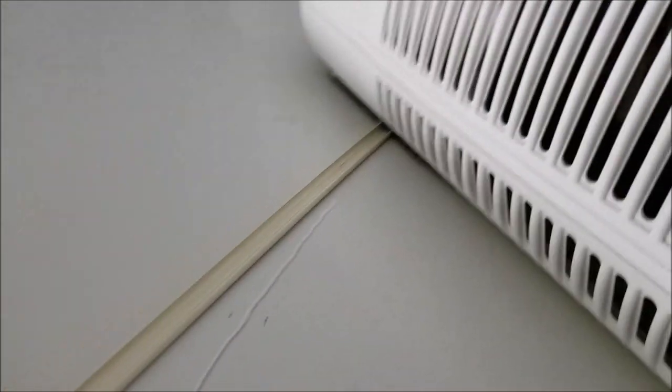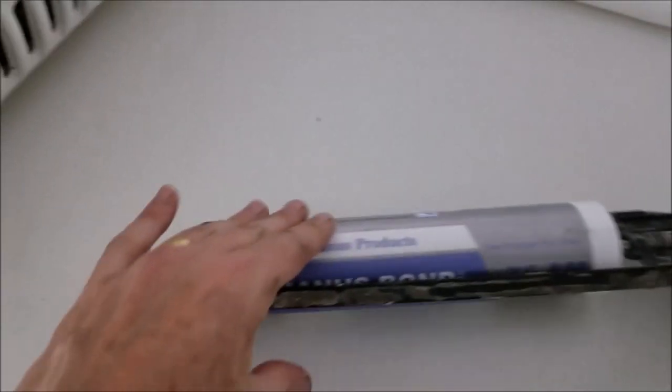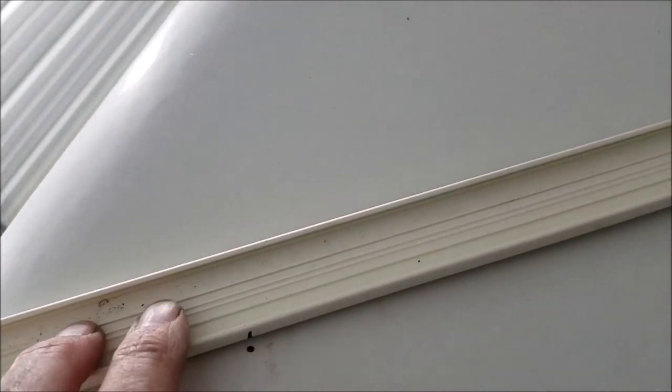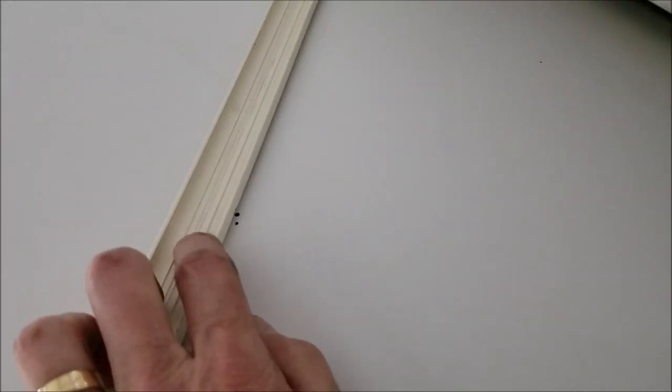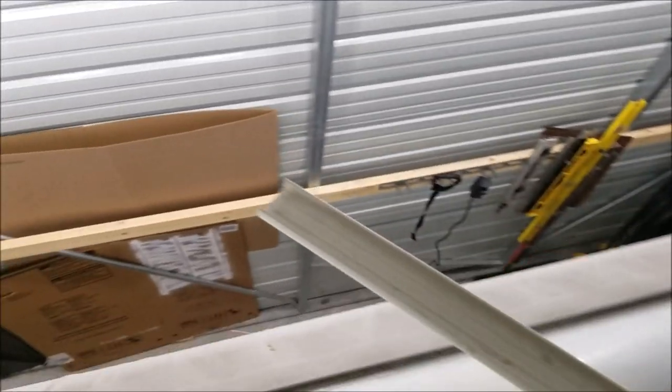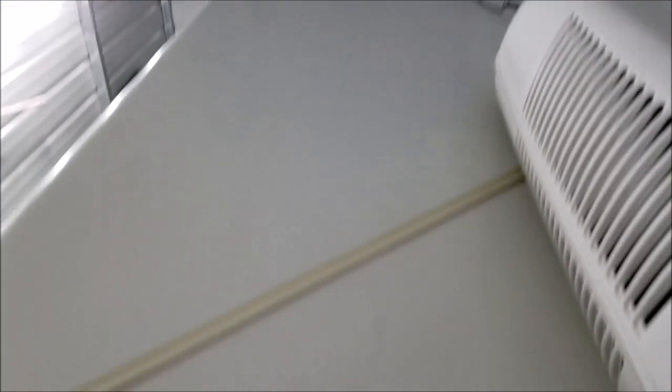Okay, I'm working on my gutters now. I've laid a bead of this really good stuff - Manus Bond 75 AM - it's white polyurethane. There's my gutter and I made some little dots to mark where I want it to come out to, so it'll drip just past the RV. I'll lift up on it, try to line it up best I can, drop it down - there we go. Let that press and set up, and hopefully that'll hold it. I think it will. Turn the airs on on a nice humid day and we'll test it.